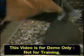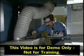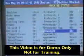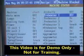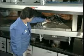Once the solder pot is up to temperature, skim the pot. Then remove the flux tank cover. Now, turn on the hood lights. Also, turn on the conveyor and the preheater. Verify that the convection blower is turning. Allow the temperature to stabilize.